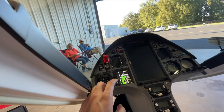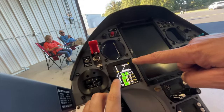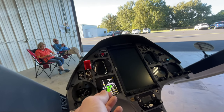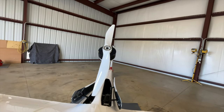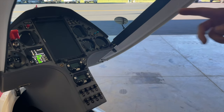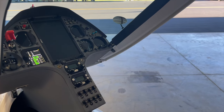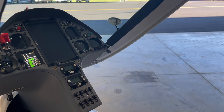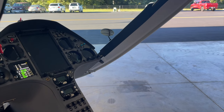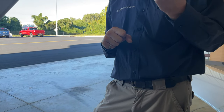Pressing up again — right there, also up — and look what happened: it went from auto to manual. Now with that toggle switch you can position it where you want, up or down. Normally you'd verify throttle is at zero before hitting down. But the other way: let's say you're at full power and you press down — it's going to take that as an emergency shutdown. It's going to go to zero, center, and retract, all based on that one command.